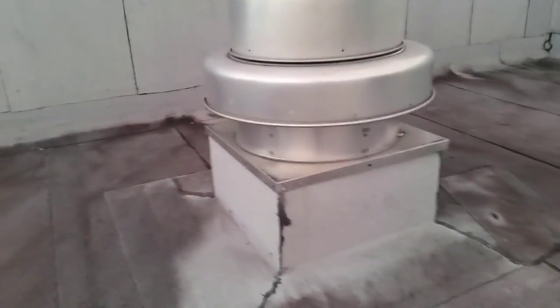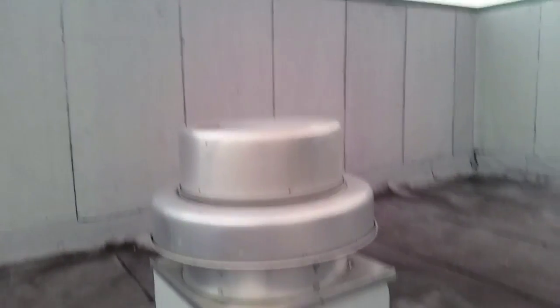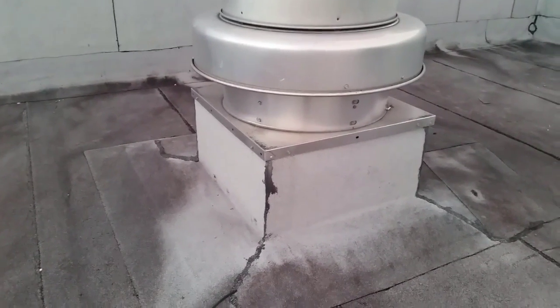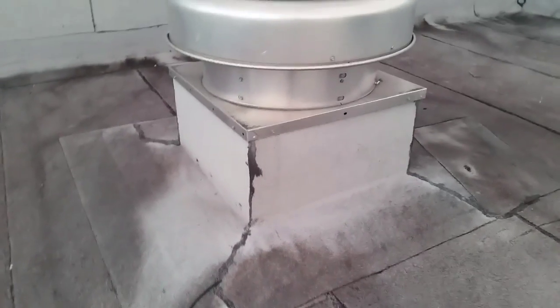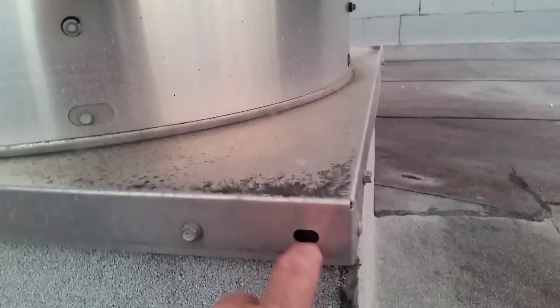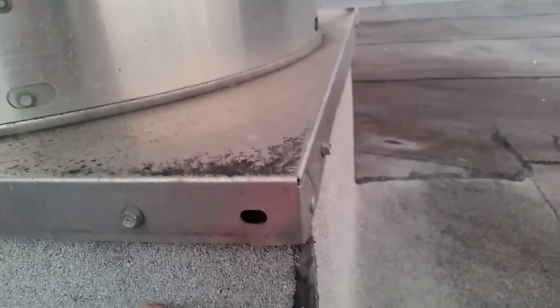Okay, this is the Doral Ale House. One of the leaks is around this vent right here, inside of the right where it goes out to the patio. We've got to put a piece of counter flashing. You can actually see it's coming in right into the flashing. I found water in the flashing there.